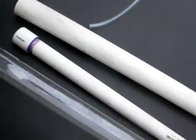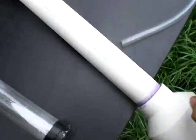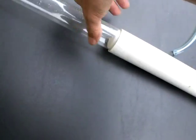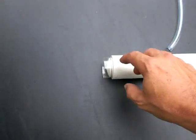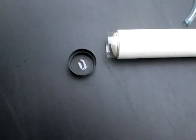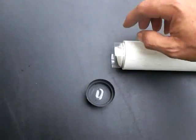What I ended up doing, after this was assembled and I had the thing right where I wanted it to be, is I took this tube — think of it as a four-foot tube — put it in here, and I made a mark all the way around where I wanted the tube to be, and then I just added enough distance for this cap. So you'd basically put the tube in, mark it, and give yourself enough room for this cap — in this case I want to say it's like seven-sixteenths of an inch. That's where I made a second mark, and that's where I cut it off.